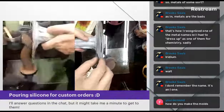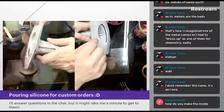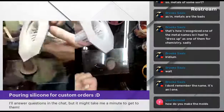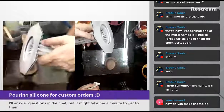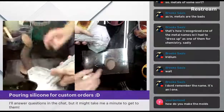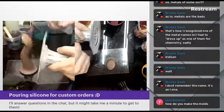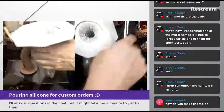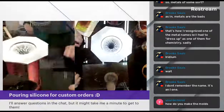I don't know if you can see that, but there's 5 layers. This is only maybe 1/8 of an inch thick, 3 millimeters thick. So, 5 layers at 1/8 of an inch. You can do math, right? That's about 2/100 of an inch thick on each layer. So I'm just brushing it on and making each layer. And I'll use a different color for each layer so that I can see that I've covered the previous layer. Then just pop it off and trim it down so that it fits my mold stands like that. And I'm off and running.